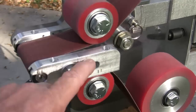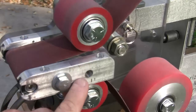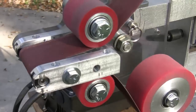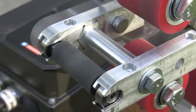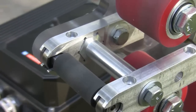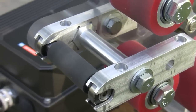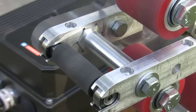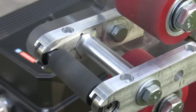The outer edge on this area back here will be cut off, and that'll make it easier for threading the belt. This bracket has two bolts — one long bolt that goes all the way through, and one short bolt that goes in the back side to stabilize it. To keep it from rotating, being it's only held by the front bolt, there's a hexagon-type keyed system, and that's on both sides of this intermediate spindle here.